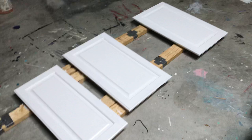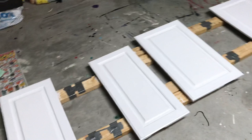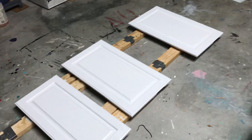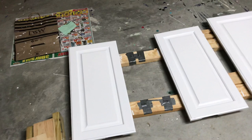Closing shot here — the cabinet doors came out great. This is just after the first coat, so they've been cleaned, had a coat of primer, and the first coat of color on the fronts and backs. I'm just getting ready to do the second coat. I wanted to show the tip about using the nails and duct tape. Obviously be safe — we don't have small kids or pets in here, so I didn't worry too much about the nails, but as soon as the project's over I'll take those up. I'll have to throw away the duct tape but I can reuse the two-by-fours and roofing nails.